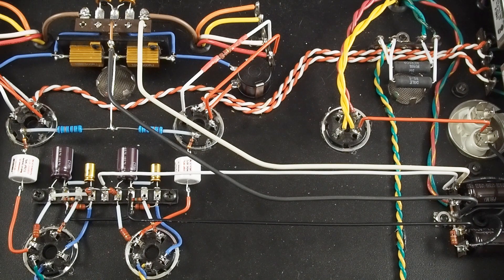I then powered it back up and started checking all my voltages. This was a design I came up with because I couldn't find anything online showing these old globe tubes used for an amplifier the way I'm going to use them. I calculated all the values for these resistors to get the voltages I wanted. I was expecting to have to do some adjustments, but all these voltages came out almost spot on. I powered it up first on the Variac to make sure nothing was way out of range, then plugged it into line voltage using my isolation transformer and checked all the voltages.